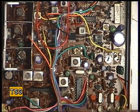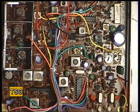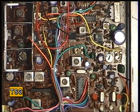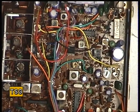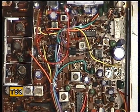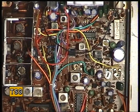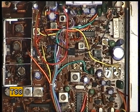Now it's pretty high — at the moment it's 27.79138. So we'll just pull that down slightly. This is what makes these sets topsy-turvy, because if you get the 10.24 wrong, or set the transmitter using the 10.24, you end up with the receiver going lopsided. Now we're set up for transmit on 27.79125, and of course we'll come to receive later. We've got 3.2 watts on this radio, so I'd like to pull that up a bit. Although all these are still factory sealed, I'll just go through it with you — it's a bit laborious because you've got to melt all the wax in the coils with your soldering iron.